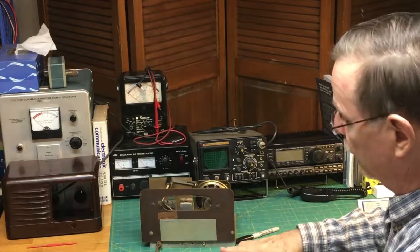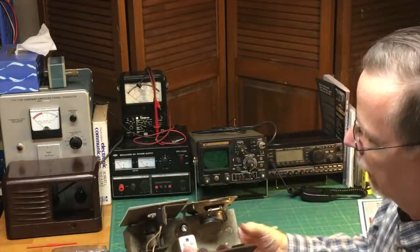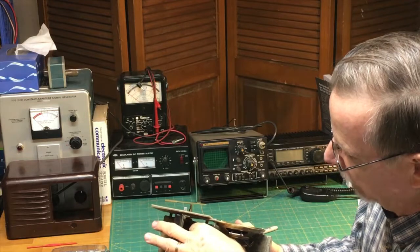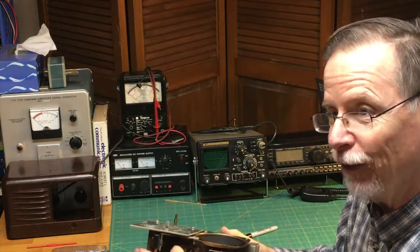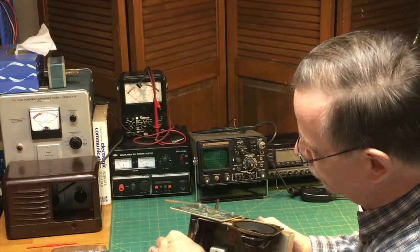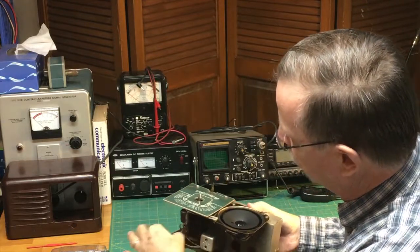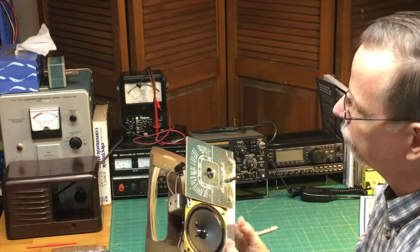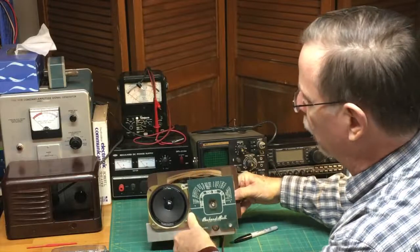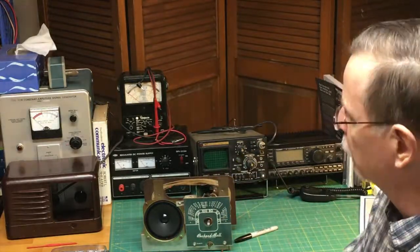And I'm going to be pulling out the rest of the tubes here. Now vacuum tubes of this era are pretty easy. They're just pressed into the sockets. So you just take it and wiggle it a little bit, not too much or you'll bend the pins. Wiggle it a little bit back and forth, kind of like you're removing a tooth that's coming out from your 3-year-old child. You just move it back and forth, and it comes right out. And the same thing over here, very gently. And same thing over here. Now what I've already done is I've taken out the bulb here for the dial light. You can see it's just held on by a bracket to the speaker, and this is a bayonet type bulb. So what you do is you press in and turn it for it to pop out. All right, so we've removed the tubes and we'll go on to talk about what's next.